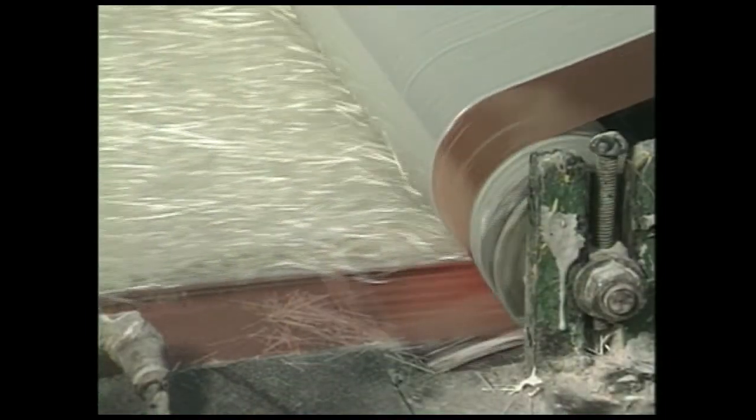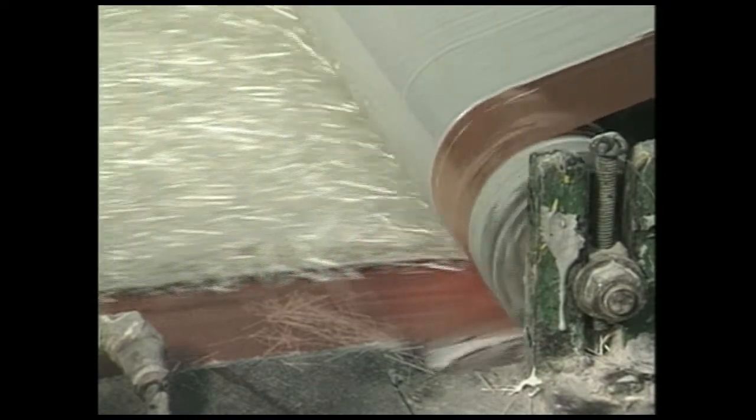To review, sheet molding compound is made up of a top layer of mix, a layer of fiberglass, and a bottom layer of mix. The material goes back and forth through four sets of rollers, which compact the fiberglass and the mix together, called wetting out. The rollers compress the glass and the wet mix to form a solid sheet of SMC.